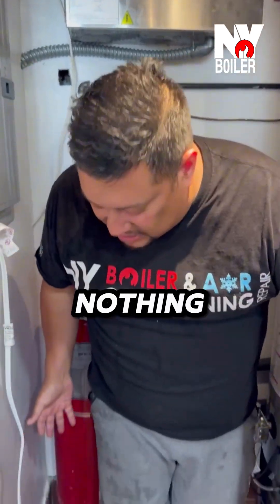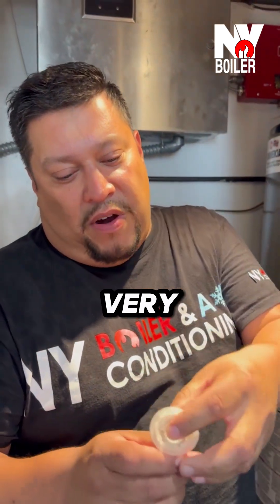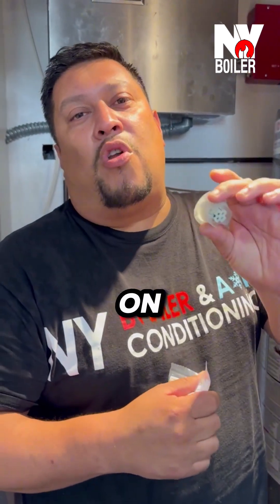As you can see here there's nothing here, so what you got to do is take the voltage meter and read the resistance on the actual vapor sensor. We're doing something like this — very simple. You put your two prongs here and you read resistance. So I put them on and guess what? I have no resistance. So it's telling me it's open.